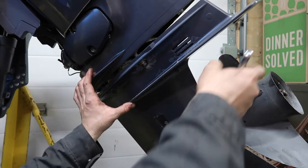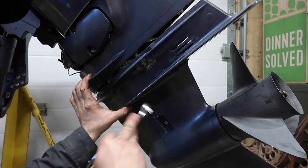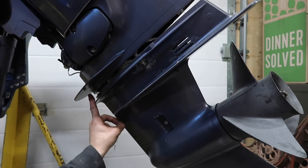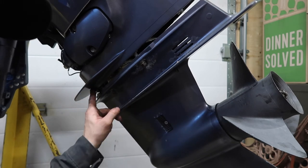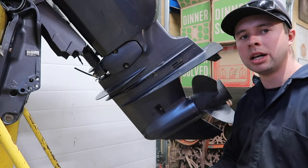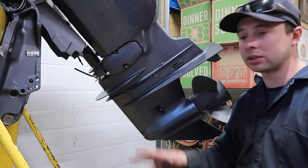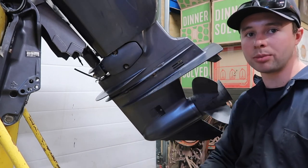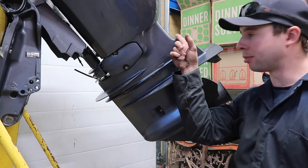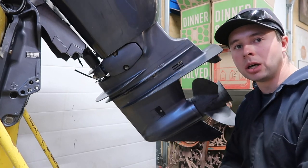Some guys leave it in gear and turn the propeller to twist the drive shaft and line it up with the splines up top, but I prefer neutral because it's easier to line up your shift splines when it's in neutral. All right guys, that finishes up our 90 horsepower Yamaha impeller change. There's a lot of stuff you can do differently — of course I never torque these bolts, but you're welcome to. I usually give them a good hand-tight snug and you're good to go. Make sure you put your bolt back here and your bolt through the top for your trim tab, and put on your rubber grommet.